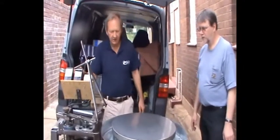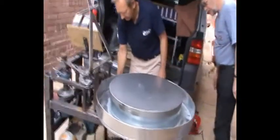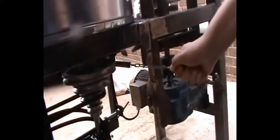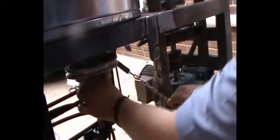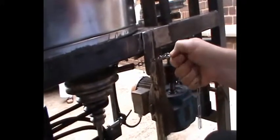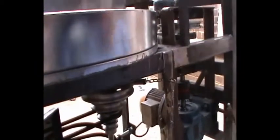We need to tension the rubber. The swing arm that the drive assembly is on is being biased, and there's a chain which you can pull on — which has got a spring underneath. The spring is tensioning the wheel. You can see the arm can move away or it can engage, and you just notch it like that for the next position if you want more tension on it. Now you can't move this by hand because of the gearing on the motors.